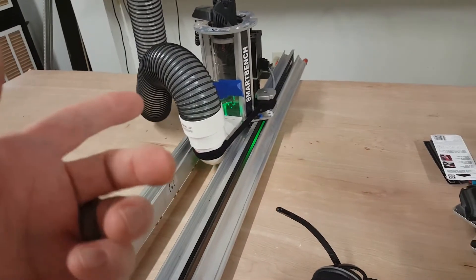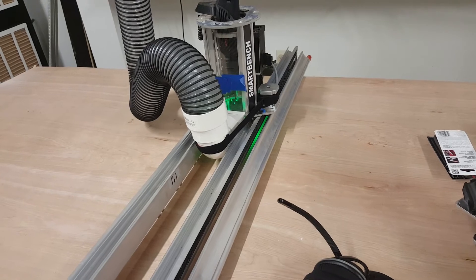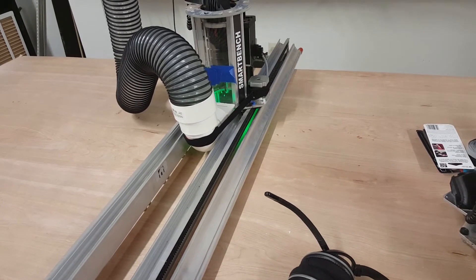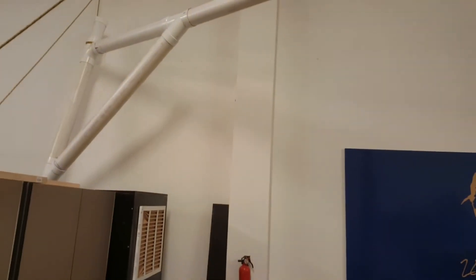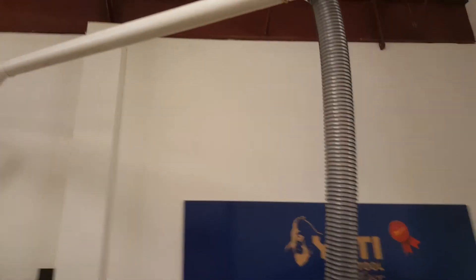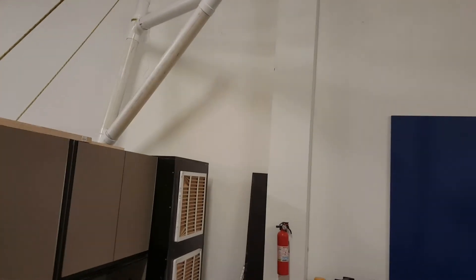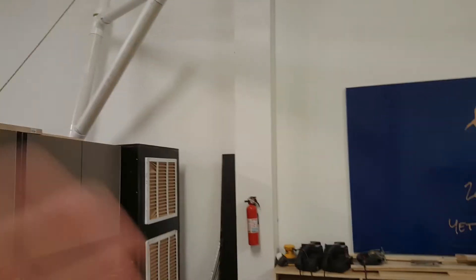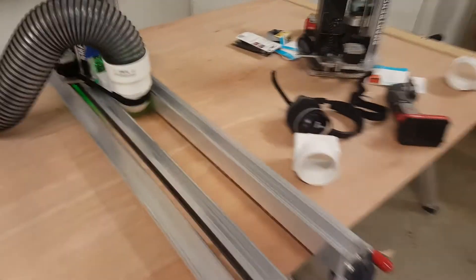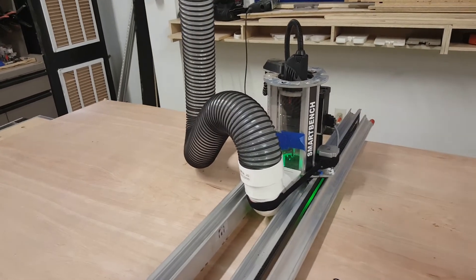What you have to remember is the 4-inch dust collector — that's a JET 650 — pulls 650 CFM. A typical shop vac may pull 150 cubic feet per minute. That's a significant difference. I've got this coming across over the tall cabinets here — my piping. It's basically going to be a boom setup. I did a 45-degree in it to help support it. It's probably 10 to 12 feet long total, connected to the dust collector on the backside of these cabinets. I'm going to connect that to the wall with U-brackets so it can pivot whichever direction I need.